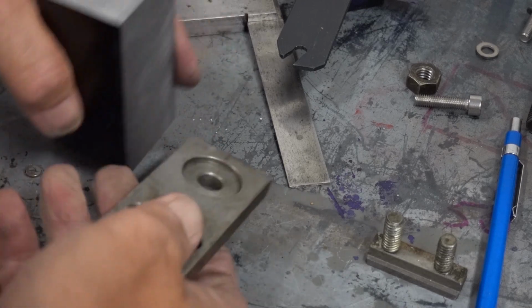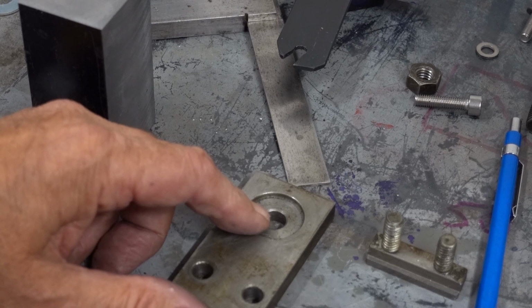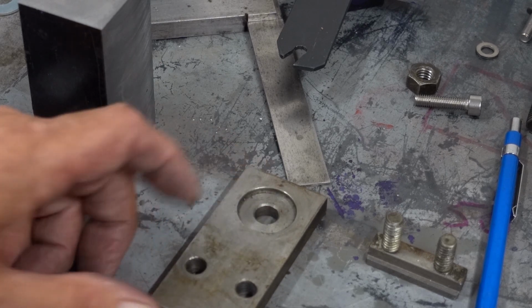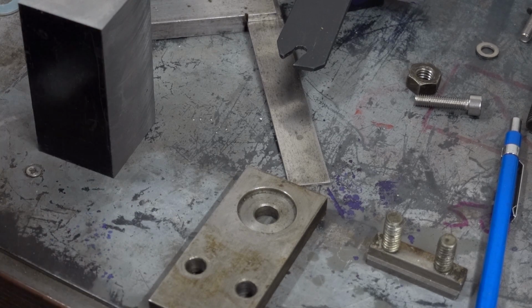And so that would become one structure, and the centre bolt goes all the way through that one. So instead of just being held on one single bolt, which is what I believe the Myford one is, some people on a model engineering site have said be careful, especially if you've got an import lathe, the cast iron isn't always too strong, and you could pull a T-slot out. I'm not sure on the Myford whether you would, because they're quite tough, but anything's possible if you had a jam up that you could pull the T-slot out and damage it.